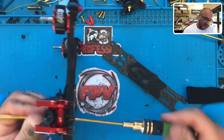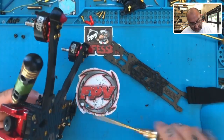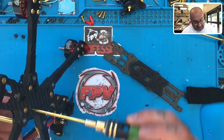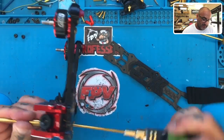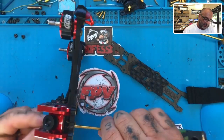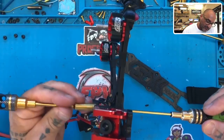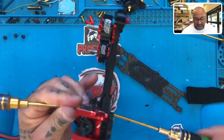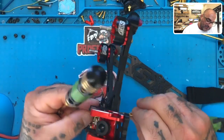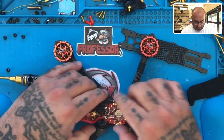I mean, this is definitely cranked down too hard. So I will say that right off the bat, if this was me, I'd be like, look, I couldn't do anything about this. And it may be that it didn't do anything. We're going to see. But you have to realize that you've got components on both sides of these boards that can easily short out. That's just the way it is, which is why we have our standoffs, which is why we try to keep about 5 millimeters of space, perhaps. All right. So the board is now able to be removed.